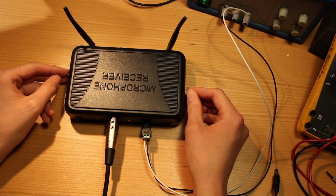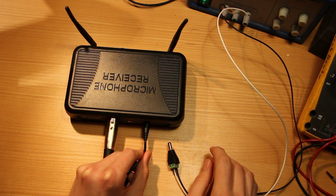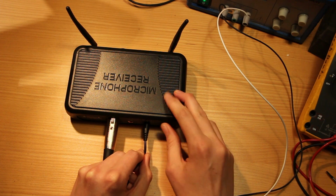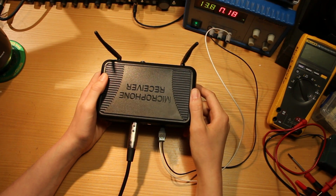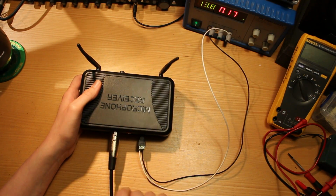That might be a very slight improvement, but the bulk of that noise definitely seems to be there. Yeah, that sounds very similar. I don't think much of that noise, if any, is coming from the power supply, but we can go ahead and leave this connected to the linear supply just to keep that ruled out. So I'm giving it 13.8 volts, the same as the open circuit voltage on the wall adapter it shipped with. And pardon the broken segment on my current readout.